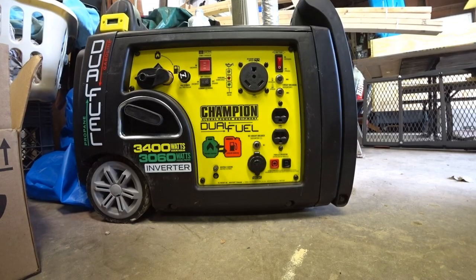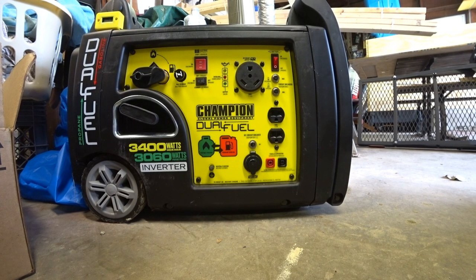In my case I want to run on propane, so I'd have to get the little Honda and then convert it to propane - the expense of buying it and converting it. And with the elevation issue, running on propane makes it even less effective. For example, our Champion generator here is 3,400 watts on gasoline but only 3,060 watts on propane. At high elevation on propane it might only be 2,600 watts - just enough to run the rooftop air, but considerably less than you'd expect.